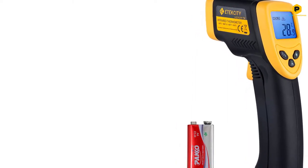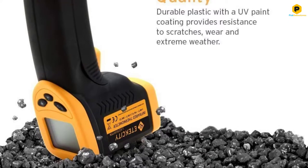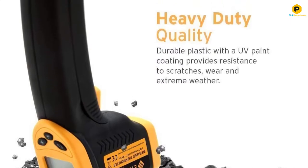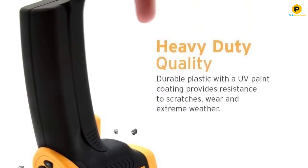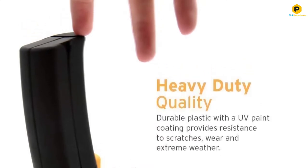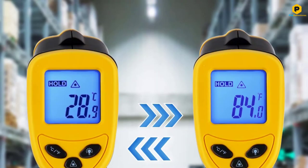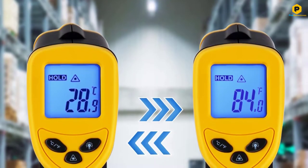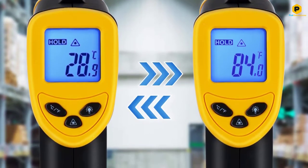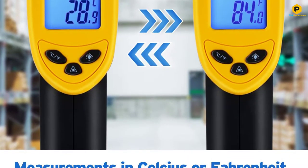The display screen is also backlit for ease of use when there is low light. The Etekcity's Lasergrip 774 has a fixed emissivity setting which limits the accuracy of the device on reflective surfaces. If precision is important to you, take a look at our top recommendation, the Fluke 62 Max Plus IR thermometer. The 9-volt lithium-ion battery is included, and a couple of features have been built into the infrared thermometer to extend and monitor battery life, including an auto-off function and a low battery indicator.